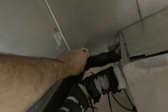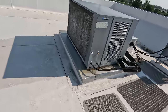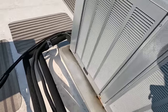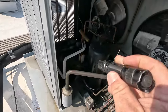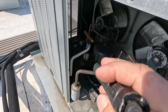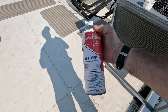We've got heat on the liquid line and the suction — I can barely get to it. Let's go upstairs and see what's going on. I'm not overly impressed; these Masterbuilt units are having a lot of problems — leaks and everything else. There are bees all over; must be a nest in there somewhere. That suction line, which should theoretically be hot, is frosted up.